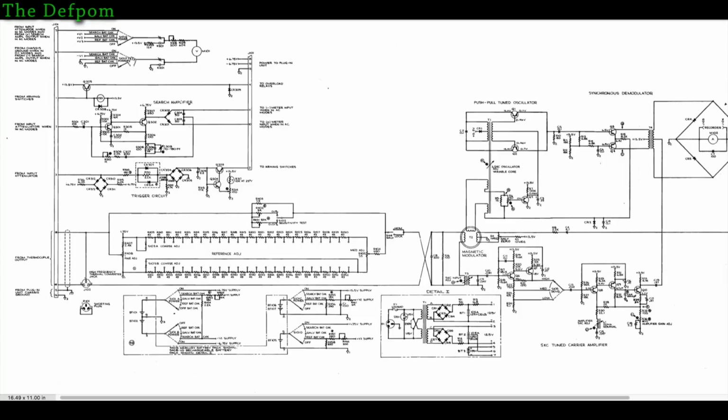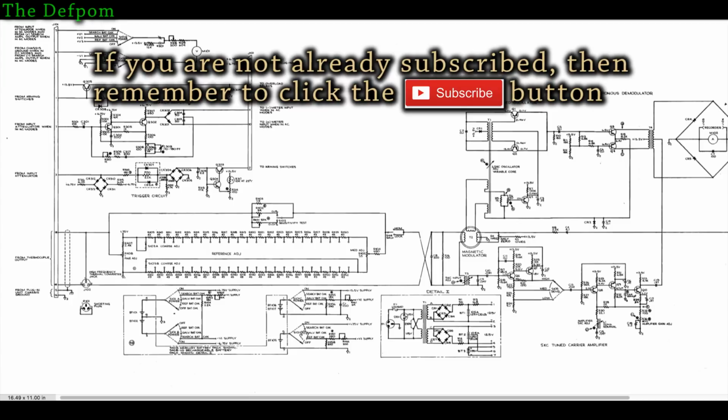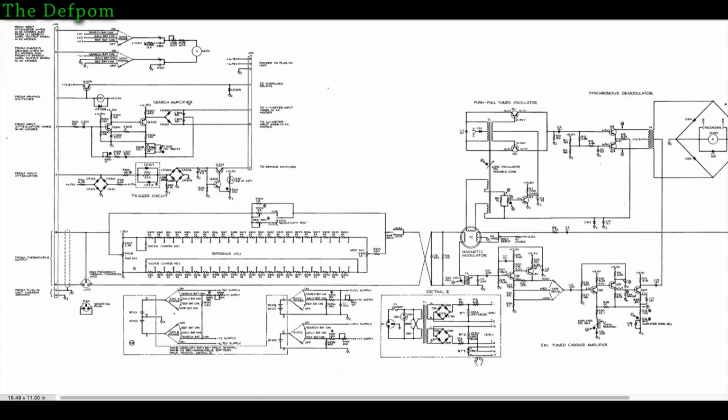Now this is that main power switch here, and here, right, S101 is the power switch. So that's got 6 sections. So see, it's got a bit going on. This is the main NiCad battery pack section just here, right, which is also depicted like this as well. It's got 2 separate battery pack sections for the NiCads, and this one here is the Mercury battery just here, right, which is one that we're actually working on right now.